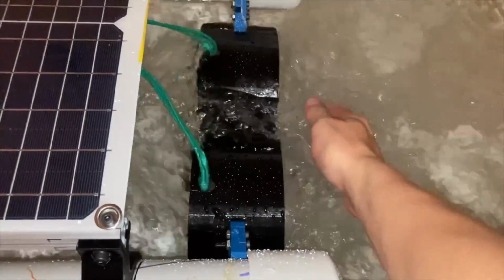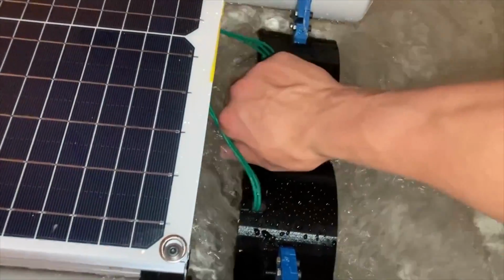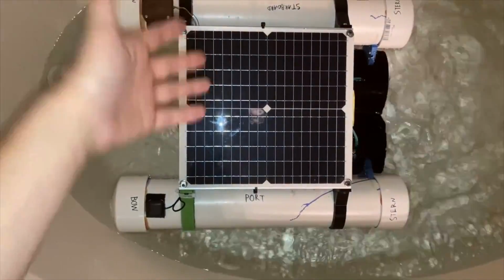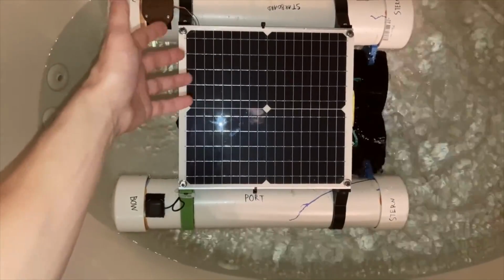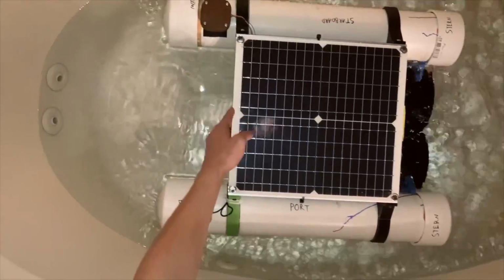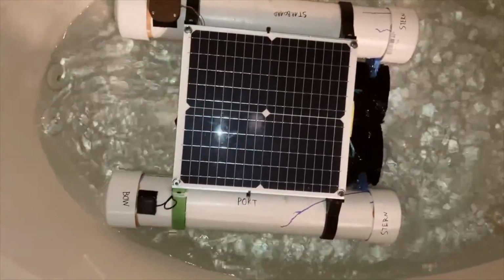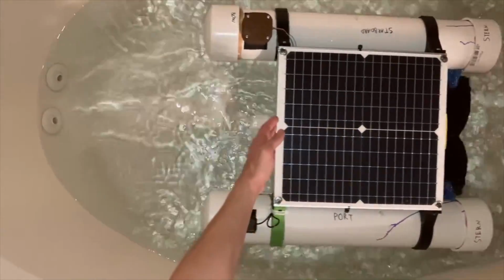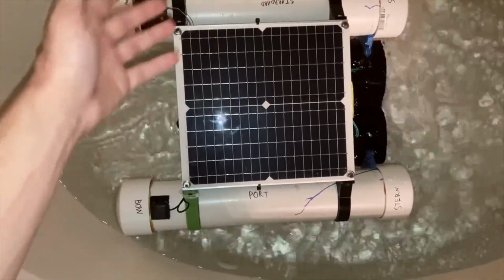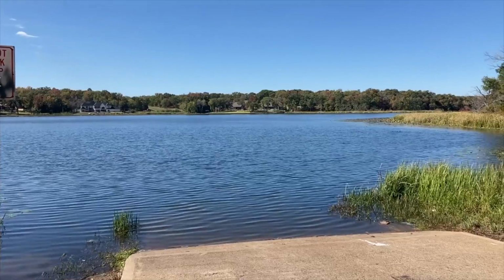And I can qualitatively feel a decent flow rate of the water, and I can feel some suction from the front. Even at 40% throttle, which is what it's currently limited to, I can feel quite a bit of thrust. Hopefully this will give you an idea. Feels like it's maybe 5 or so pounds when I push it back with my hand.